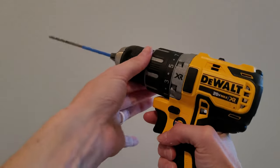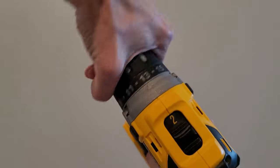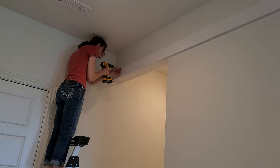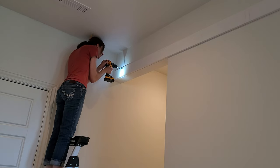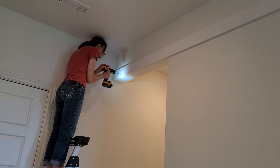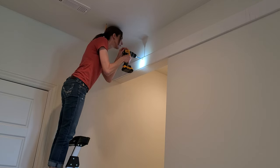Here's a close-up showing I used my carpenter square to get those three quarter inch marks. Then I moved my drill gun to two and the drill option, made sure the bit is smaller than the screw, and put a piece of tape so that I only drilled in as far as I needed to. Go ahead and drill those pilot holes all the way across — it will make sure that your header board doesn't split or crack. It's one of those things that makes a huge difference.